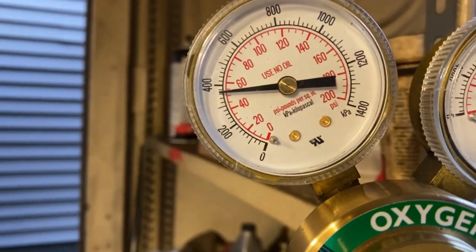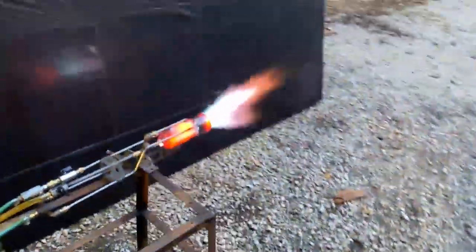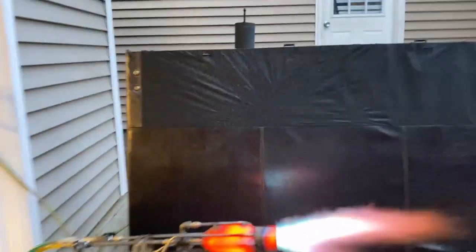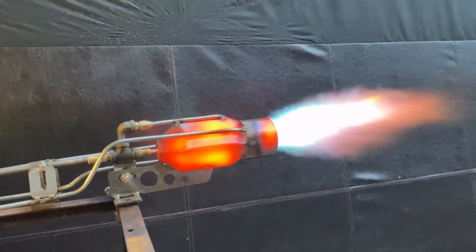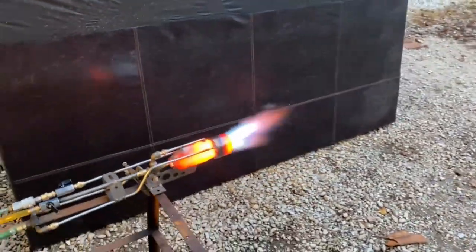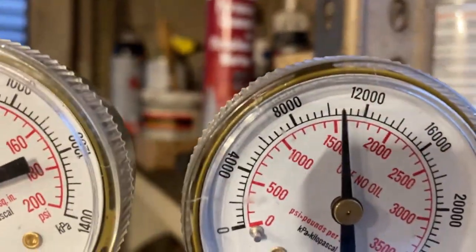Here is a little bit of oxygen added and you can see it really reduces the size. I need to aim those nozzles a little bit to converge just right. You can see that the gauge is slowly moving so this little tank wouldn't be ideal, but with a good-sized oxygen concentrator that you can connect to a large air compressor I think we'd be in there. My next move is to build a two-tank oxygen concentrator that just hooks up to an air compressor — not one of those big expensive medical type setups. This thing is so loud that I couldn't get my decibel meter to read it right, so I'm looking for a decibel meter that will function above 100 decibels. This is at about 40 psi of oxygen.